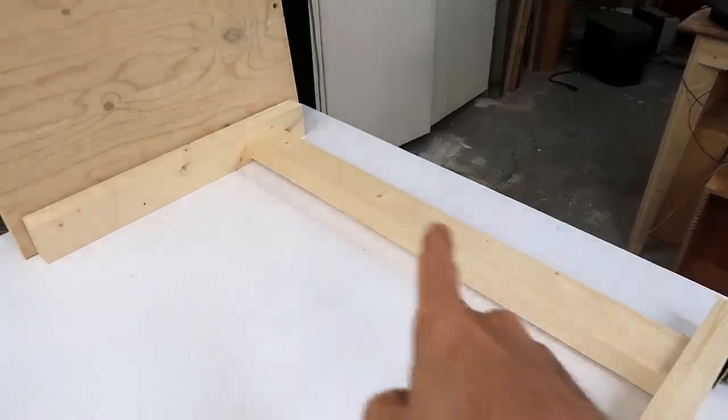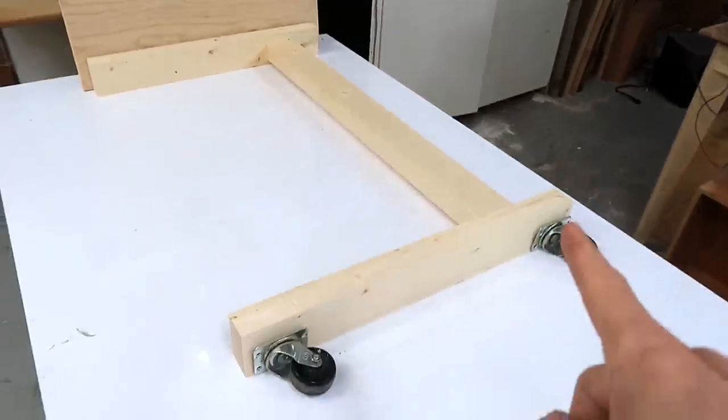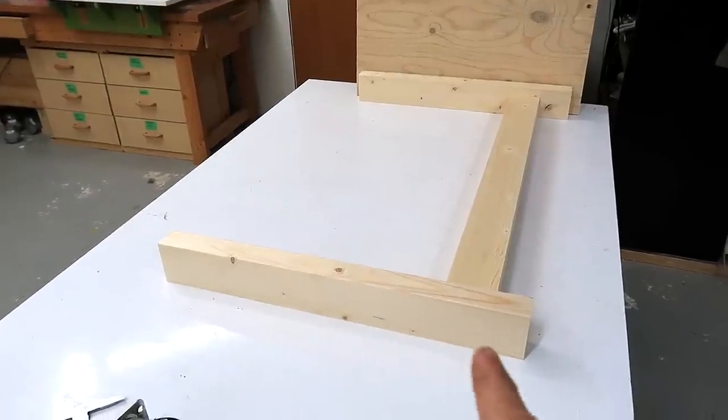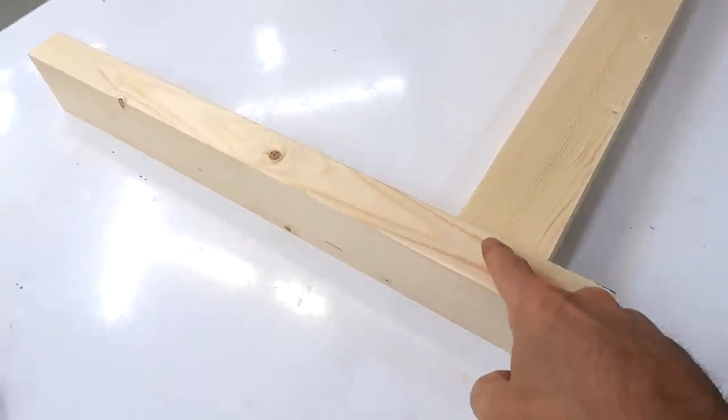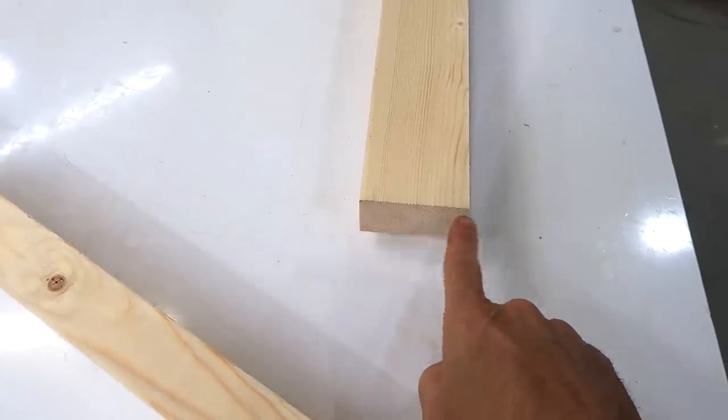There's just going to be two legs attached to horizontals — one under the table, the other one on the bottom so I have a place to put casters on. With this cantilever like that, the strength of this joint is key, so I'll be putting as many mortise and tenons on here as I can fit.